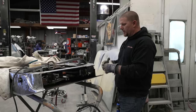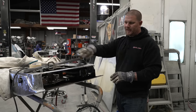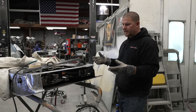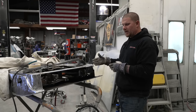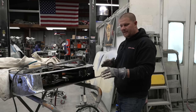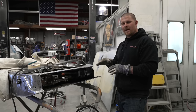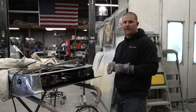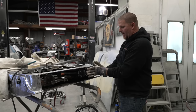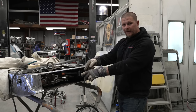At this point, you could seal it up in epoxy when it's all ground smooth and then just come through and DA everything and epoxy it and put a skim coat of filler over there if you wanted to. The goal here is minimal filler, so we're just going to try to work on keeping our heat down and our fitment as good as possible. Better the fitment, the less amount of heat input that you're going to have in the panel at any one time. Once we get this corner done and this lower piece done, we'll then come back and address the very bottom lip separately.